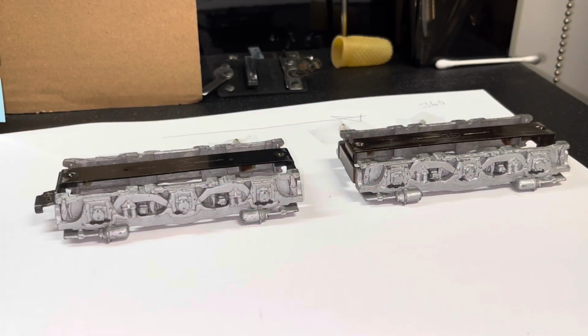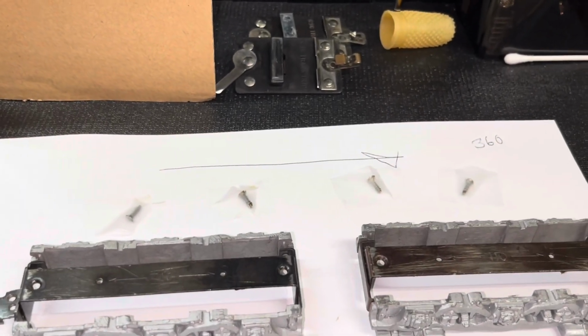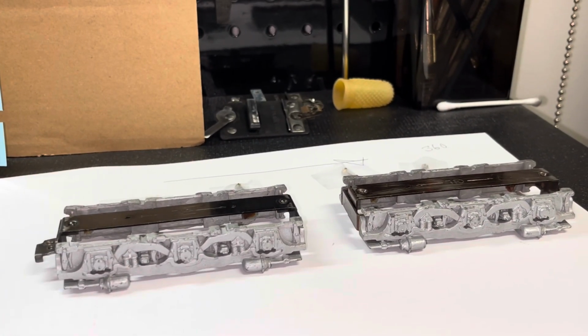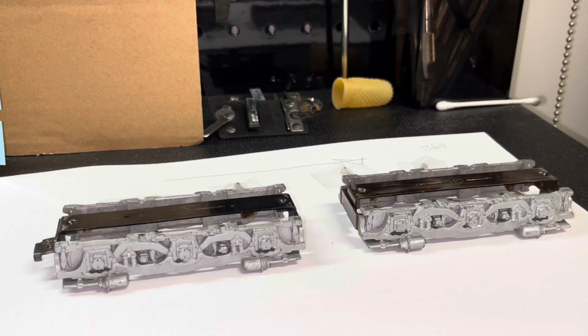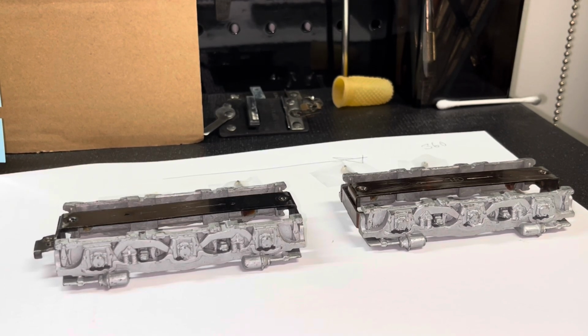The truck side and bottom plate assemblies are removed, and I've begun my standard practice of mapping the screws to paper with tape so that I can keep up with them, move them around very easily, and not worry about them rolling around. I choose this method over dropping them into cups because of my past experience, particularly with some older steam locomotives, that you're going to accumulate quite a bit of screws when you take those apart, especially coming from some of the side rod assemblies. And they can be mixed up. They may not fit when you return them back, has been my experience. I like to keep the screw, when it came from a particular place, put it back in that same place, I think giving a greater chance the threads match up.